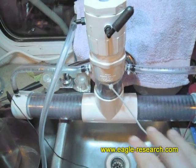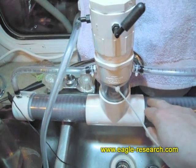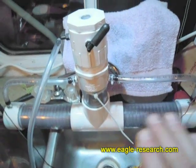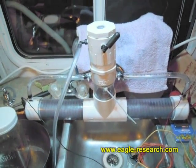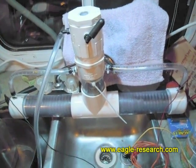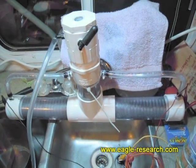If you want to go over 3 amps, it would be a really good idea to have quarter-inch holes in the plates instead of eighth-inch holes, because the gas just can't get out of the cells fast enough and it tends to lower the liquid level down too low. So the eighth-inch holes is good to about 3 amps. If you want to go higher than that, more amperage makes more gas, but it also heats the machine up faster, so you have to decide on what parameters you want.